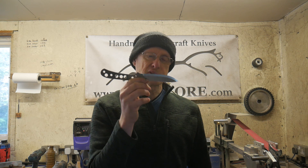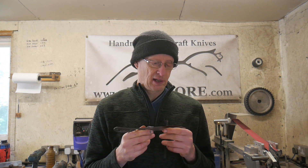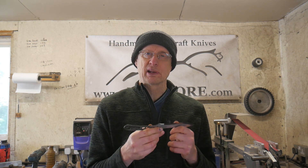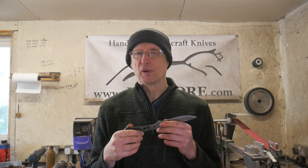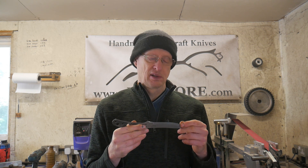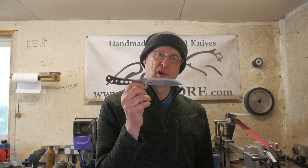So I've got the rest of the blades in a fully annealed state, but I did re-harden this one knife. This time I austenitized at a lower temperature — 1045°C. I had no dry ice, so I quenched in the quench plates and put it in the freezer at minus 18 to minus 20°C for about 15–20 minutes. Measured the Rockwell hardnesses — again about 61.5. Tempered for two hours at 250°C — still above 60 HRC. Retempered for two hours at 315°C, which brought them just below 59 HRC.